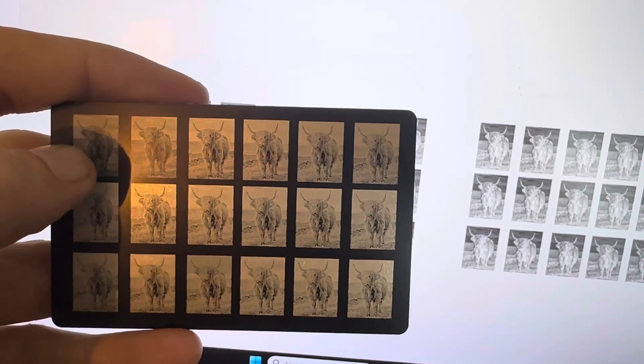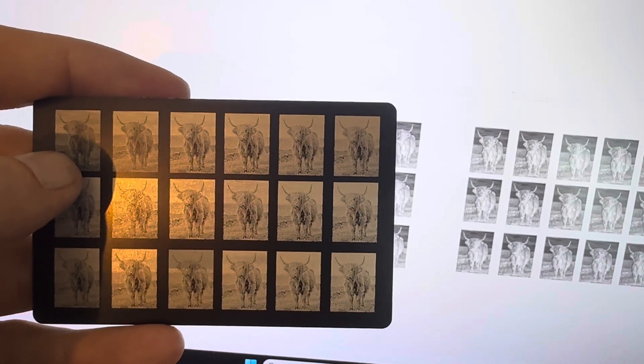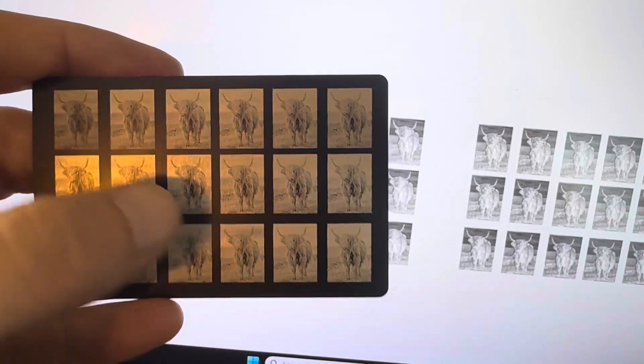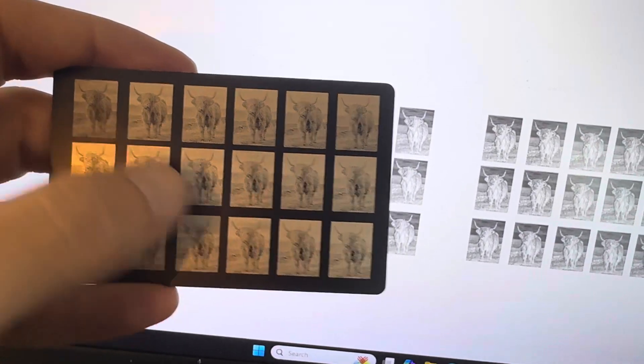The lower the DU number, the faster the laser moves — so this is like your speed on a vector. For example, say this is 1,000 millimeters a second and down here is 100. The lower the number on the DU, the faster; the higher the number, the slower. I'm going to show you here on the computer.